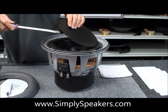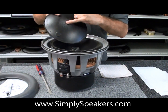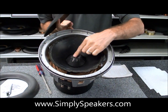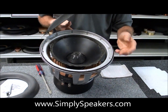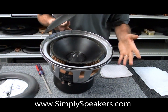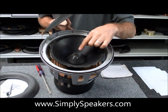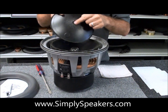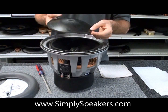And there we go — we got it. This is what it looks like. There's a little bit of adhesive pad back here. Inside the speaker there's a little pad as well, and you'll see where they applied the glue very liberally — that runs down on the inner cone. This is what it looked like when they manufactured the speaker, right out of the factory. This little sticky piece can just kind of stay in place. There's a spot on the back of the cone that's the same way — we'll reattach that with adhesive when we're done.